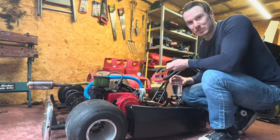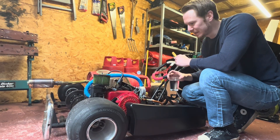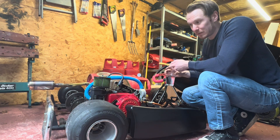So nothing really special there. We've got it running on petrol and the hydrogen mix. The hydrogen was only set to one or two PSI. I'm now going to drain the petrol out and run 100% alcohol and do the exact same thing, and then finally we'll do it with diesel.